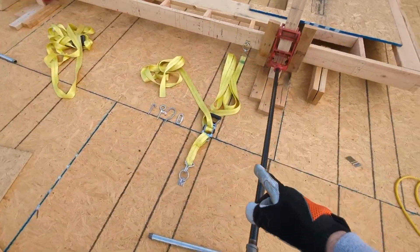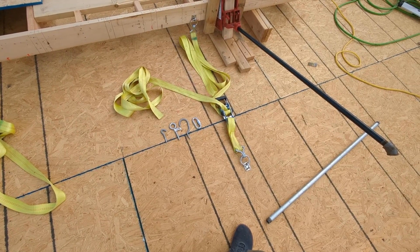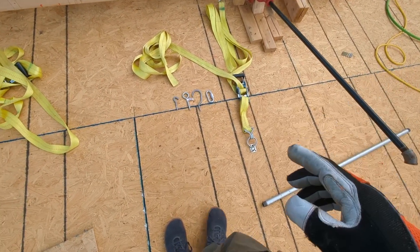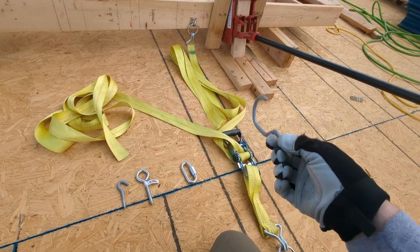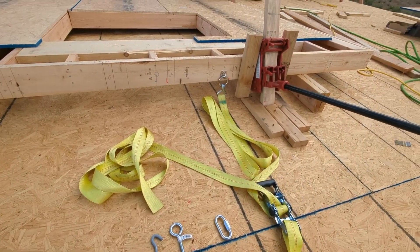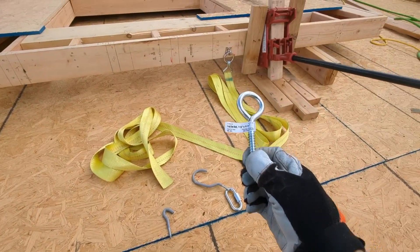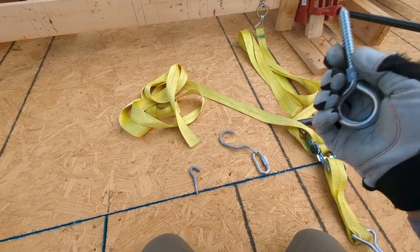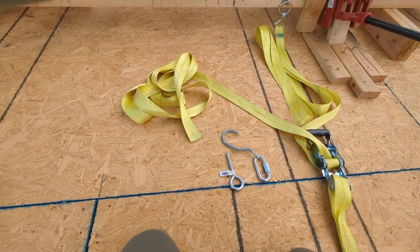So what I came up with was some hooks. I'm building in a backcountry site — a homestead — with no hardware store for 45 minutes and the nearest Home Depot or Lowe's about an hour fifteen away. So you kind of have to jury-rig. I'll show you a few things that failed. I had some hooks in the shed and figured I might as well try — I was in an emergency situation after I already got that wall in the air. This hook is too thin — about a quarter inch, too thin. About 7/16s. A good lag eye, anything along those lines driven to the top of your wall, does a remarkable job and is easily strong enough. In a pinch, one of these hooks will work if it's very short and you hook your chain to the very bottom of it — but it is pretty sketchy.